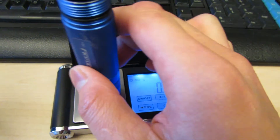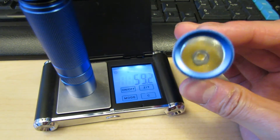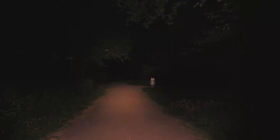After adding all that copper to the head, this one weighs 66.9 grams — so we've added a good 7 grams of copper in there. You can see that bridge no problem — anything coming over that bridge you can spot. The other light is losing some detail — it's only 60% as bright. Here's a straight down trail shot — you can see basically everything to your left and right, versus the other one which you can still see but it's just not as bright.